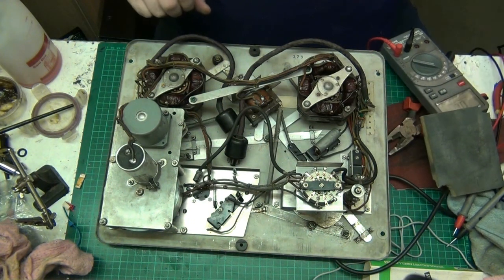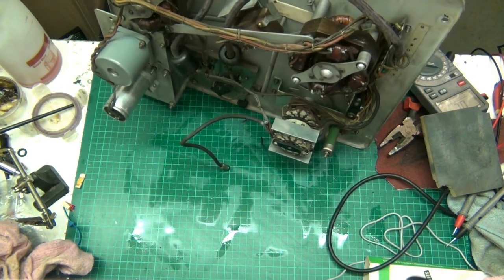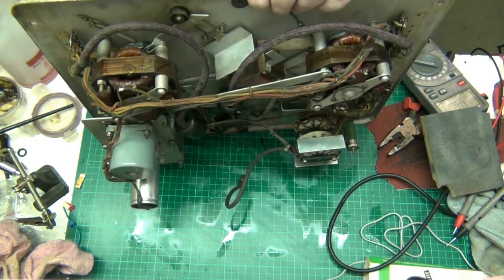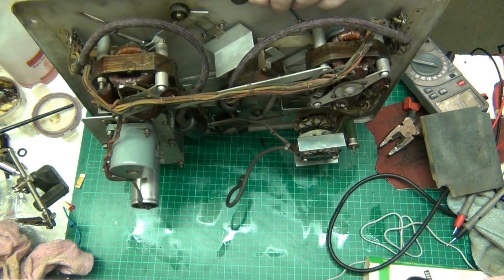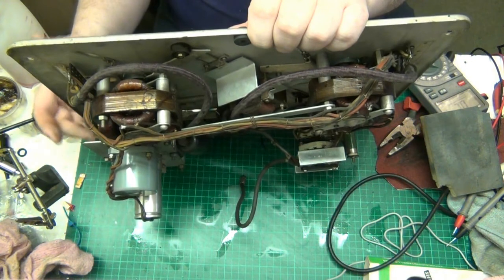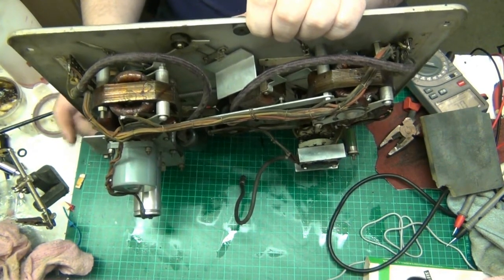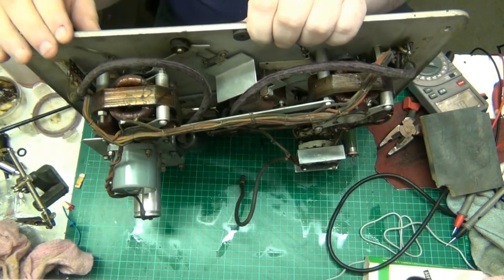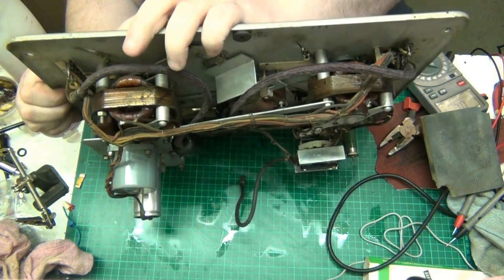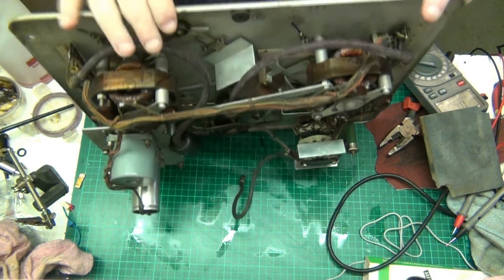If I take the brakes off maximum adjust, because I did that, put them down there, as you can see, the motor's now turned freely, and I'll do the same with the other one. I'll need to set these brakes up and stuff. You do that with that one, they turn perfectly beautifully. And they're quiet, and that'll get even quieter the longer it runs, I think. You can tell where they were set. They were set to there originally. So we'll set them back up to where they were set.